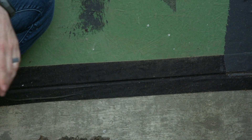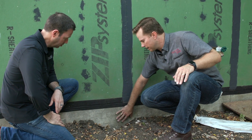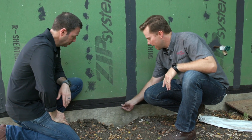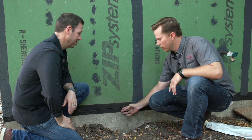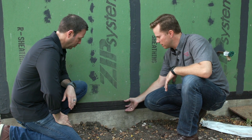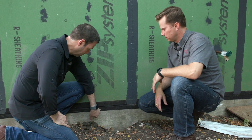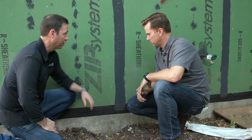Why the fleece? In our market we do a lot of what's called underpinning — near the end of the project, kind of a cheap stucco, just a smear coat of mortar to cover the foundation. This fleecy backing grips it. If you were to use a slick tape, your underpinning might flake off, but this is going to bond to that fleece tape. It comes in four, six, eight, twelve-inch widths — you can get it as long as you want.